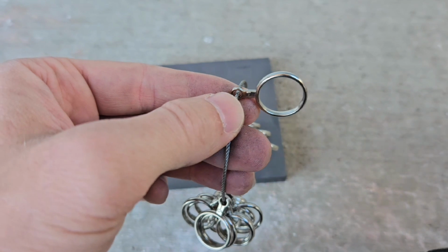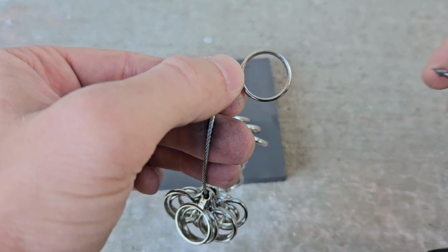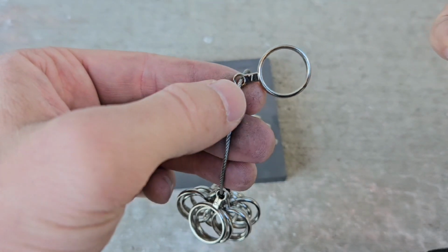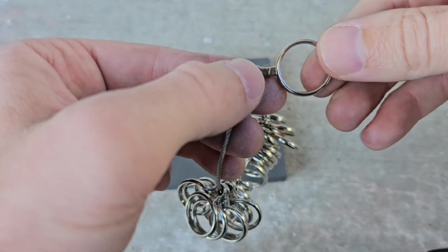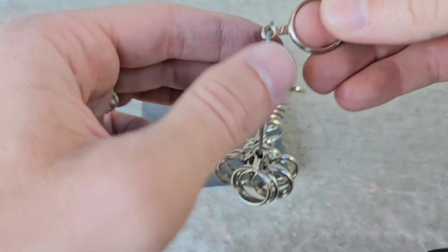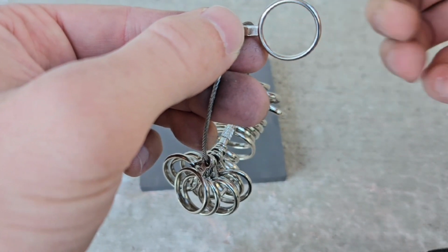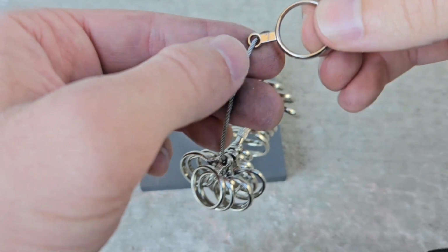The reason why is that you've got to account for shrinkage. Normally when I cast a ring this size, across the diameter of it, I lose about 0.7 millimeters in diameter due to shrinkage. So you want to make your model a little bit bigger than your final ring. I think the difference between a 6.5 and a 7 is, I don't know, like 0.5 or so. It'll still leave enough so that I can take off some of the inside of the ring to polish and get rid of defects in the surface.